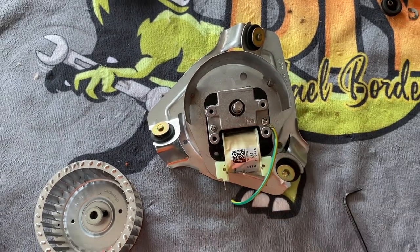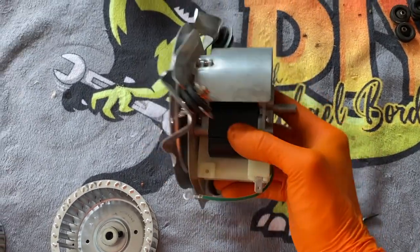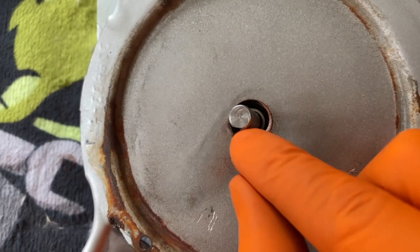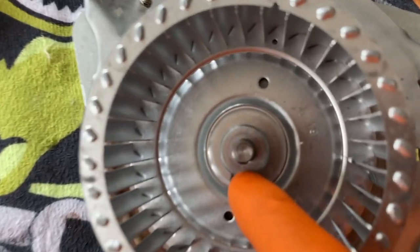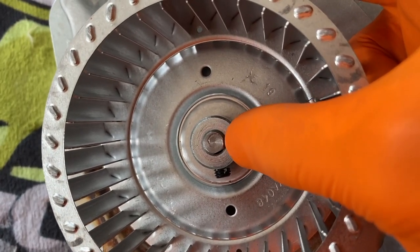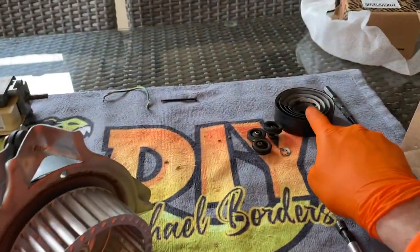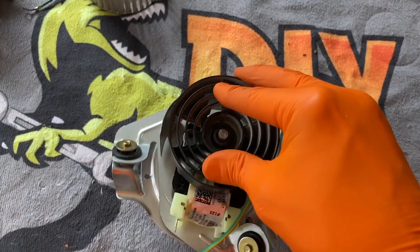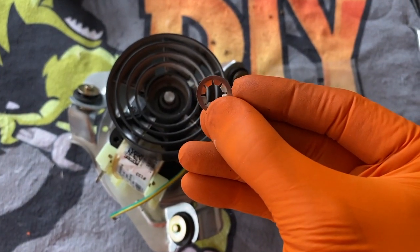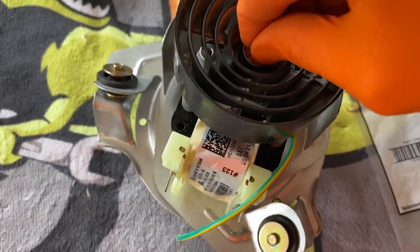Here's how it should look at this point: you've got your motor, the bottom electrical leads, and the shield above it. Carefully turn it over. We're going to install our wheel — you've got a flat portion on this rod as well. Insert your wheel and it should slide right on, all the way down. You actually want it up flush with the top portion of the rod, and the screw will secure itself to the flat portion. Fan blade wheel is secured. Now install the fan blade on the rod. Here is the new securing clip — the bottom side is indented inward and the top portion is indented upward. Slide the clip on and push the fan blade into place and secure it.